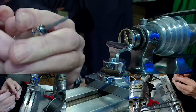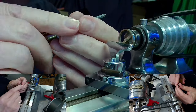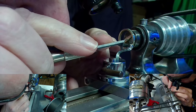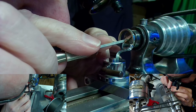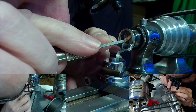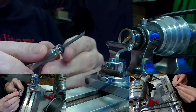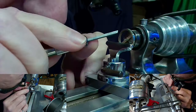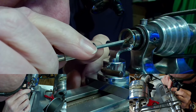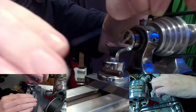I had to work on the tip of this graver — it wasn't sharp enough. But I believe I've got myself a little bit of a dimple in there for the start of the drilling. I sharpened the end of the carbide graver and you just have to press in ever so lightly to get this thing going. So that's done — now I have to set up the drilling.